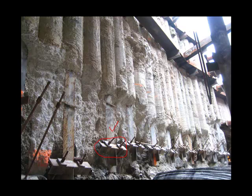The rock is very high — this is the exposed rock — so you don't have to go very far to be in rock. This rock anchor is not very deep and doesn't need much penetration into the rock to achieve a high capacity. By contrast, if you wanted to install rock anchors way up here to hold back the upper whaler, that rock anchor would have to travel the whole distance to get down to the rock.